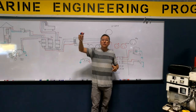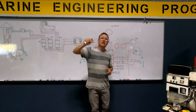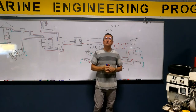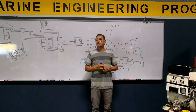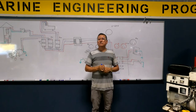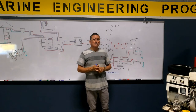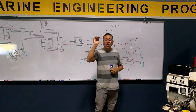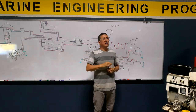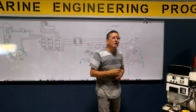However, when I turn off the breaker for shore power and turn on the breaker of the generator, I start the generator, and the frequency is 57 hertz. Is that good? No. Why not? The engine's not running properly, it's slowing down. But what is the consequence of that low frequency from the generator? Amperage goes up. Excuse me? Amperage goes up in motors.